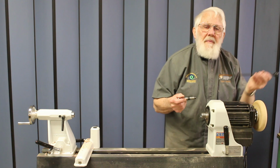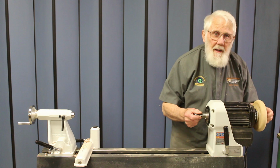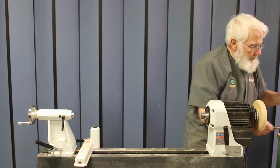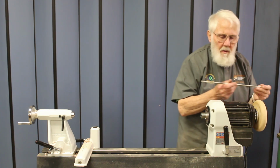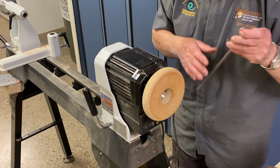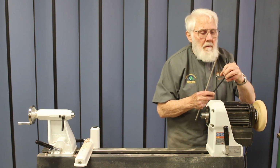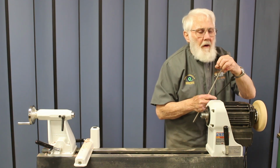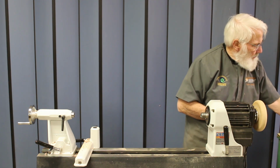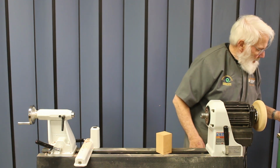We need some heft in our knockout bar, because when that is firmly in there, it needs a fair push to get it out. So we need a bit of longer and thicker steel, which we've got here. Now it's going to have a bit of spare. We're also able to take this opportunity to make a bigger, more comfortable sphere of wood on the end of that. Okay, so to do that, we'll take a lump of wood and turn it into a sphere.